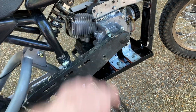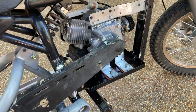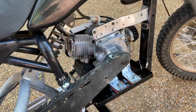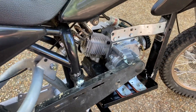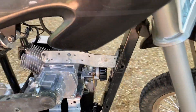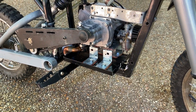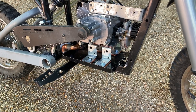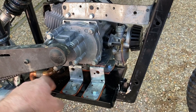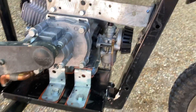I made a little bracket here bolted to the gearbox. When you get the gearbox, you're going to want to take it apart, clean it out — there are going to be some metal shavings in there. Seal it up with a gasket maker and fill it up. I think the website said 80 to 90 weight gear oil. I also put some Lucas heavy duty oil stabilizer in there. I put 1/8 inch thick rubber under all the motor mounts to help reduce vibrations.